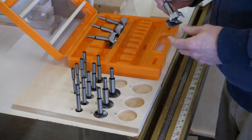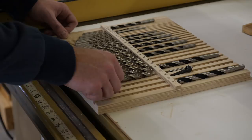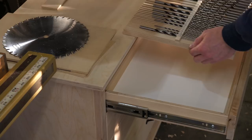I also picked up a full set of high-quality twist bits and a few brad point bits. For the Forstner bits, I wanted them sitting upright in one of the drawers I built, so I cut out a piece of scrap wood to fit the drawer tightly front to back and drilled a hole for each bit — neat and tidy. For the twist bits and brad point bits, I used another scrap of plywood, cut a bunch of grooves roughly sized to each bit, added a divider, and labeled each slot. A little rudimentary but plenty effective nonetheless.